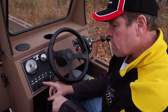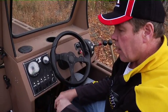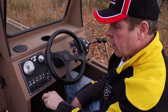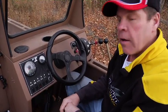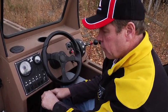Most of the time, obviously, if you're not running the boat, if you have young kids in the yard, you may want to get a battery selector switch where you can shut the battery off. Otherwise, if they play with the switches and leave that on, come Memorial Day, you're ready to go boating and the battery's dead because the lights have been on for a week.